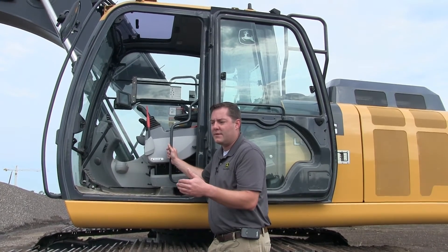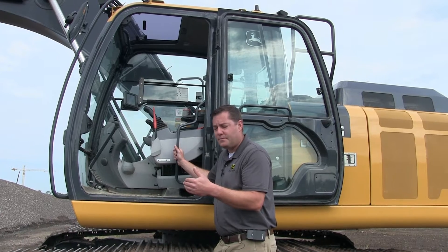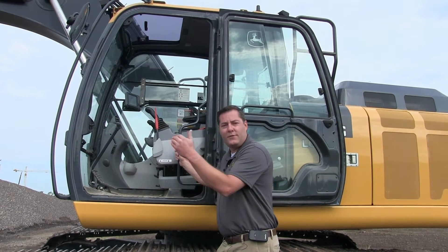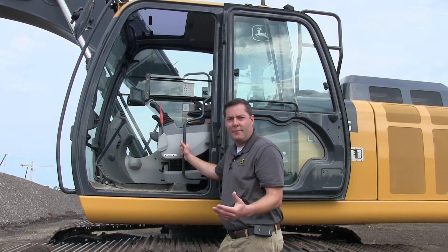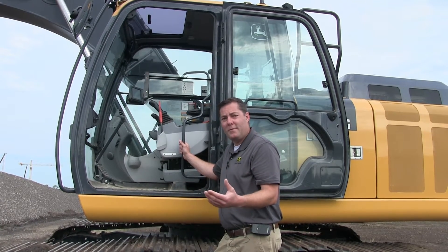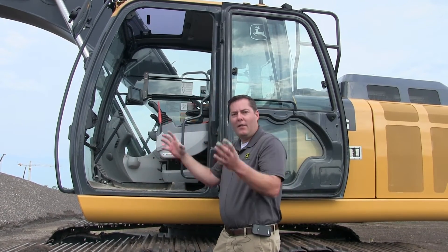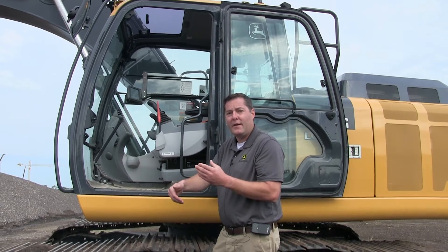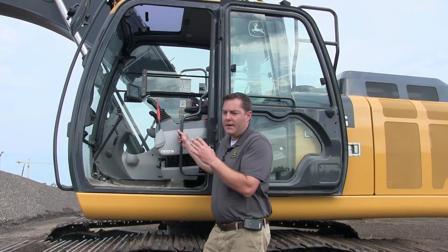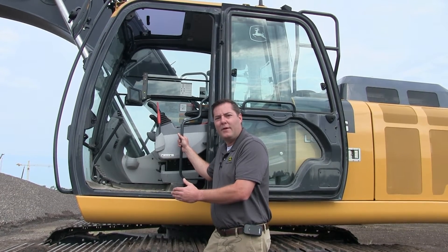You can enable over-dig protection or turn it off. It seems best suited for underground utility contractors who absolutely do not want to hit any pipes or fiber optic cables underneath. You can enable over-dig protect for that. Otherwise, as long as you have autos on, the bucket teeth will go to grade anyway, so it doesn't interfere with what the operator wants to do. They can still have full control over the machine. In many cases, if you're working with large concrete pipe that has a big bell end, you have to dig out just a little bit more to keep it on grade, and you're going to have to break the grade — we allow you to do that. The SmartGrade tools are designed to make your job easier without limiting the abilities of the operator.